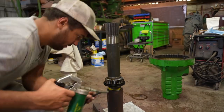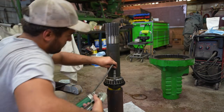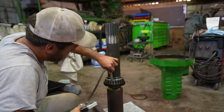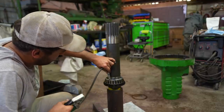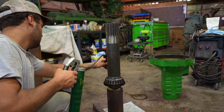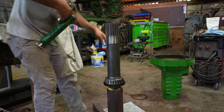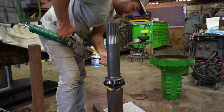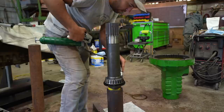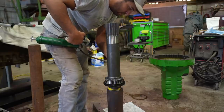While this thing's a little bit warm, you can take your grease gun and kind of halfway pack the bearing. It being warm helps that grease flow a little bit better. Usually you pack something like this beforehand, but since you're using that oil you can't actually do that for obvious reasons. This will work good enough - just got to work it in there with your fingers.